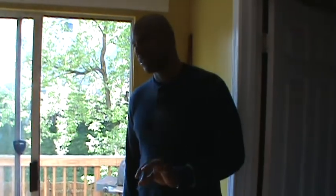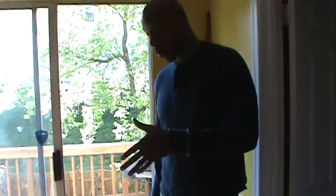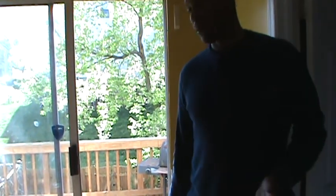Right. That's why it's coming off. There's no Durock. You can't do tile that way. And on top of that, Durock is water resistant. So especially in a place like this, in your bathroom, when the water gets between the little tiles and the grout, it eventually gets to the floor, which causes the floor to warp. And that's what caused your tile to start breaking up and shifting. So all these will probably need to be taken up, put Durock on, and then put the tile back down on top of them.